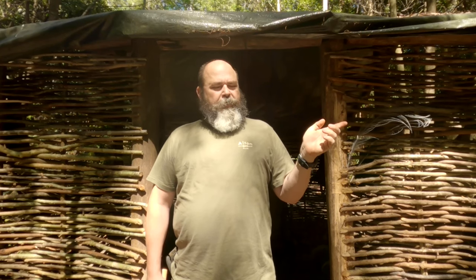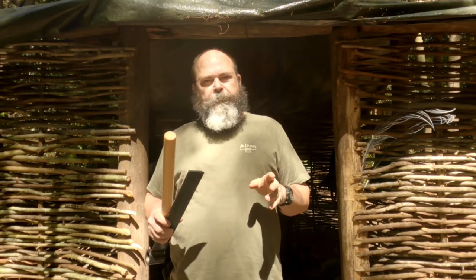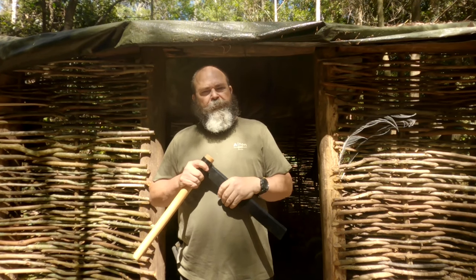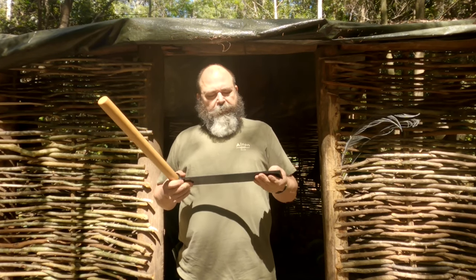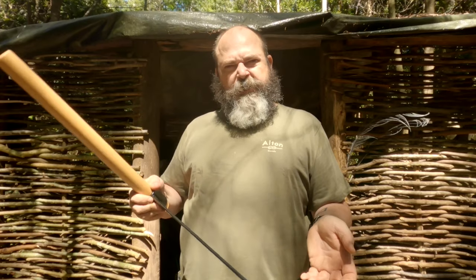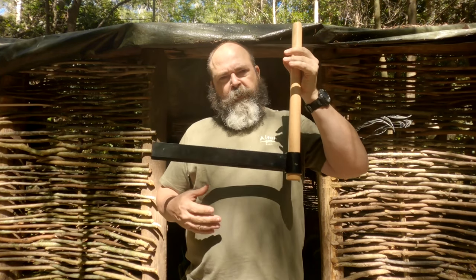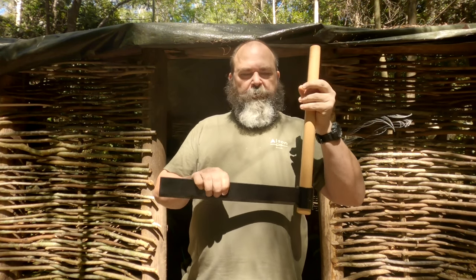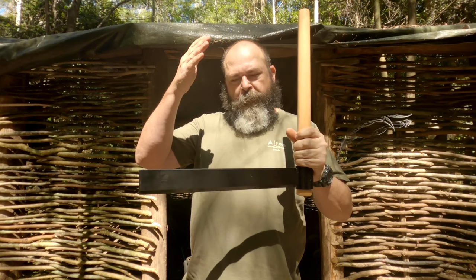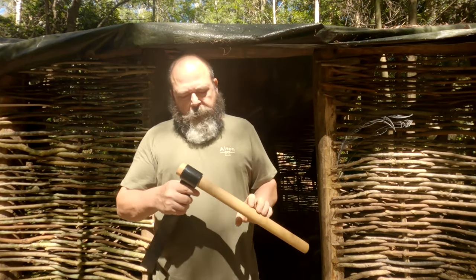I did bring a fro with me today. I'm not going to be making any shingles — I did buy this for making shingles. This is just a cheap generic one I got off Amazon, about a third of the price of a Gransfors Bruks fro, so I decided to opt for this as a tester. For those that don't know, a fro is kind of like a sideways axe, but you don't actually hit with it. You take a section of log, hold the blade along the top of the grain, hit the top to start splitting, then lever with the handle to split it off.